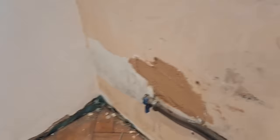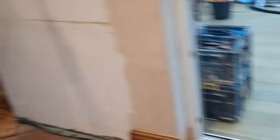All of the chases are filled everywhere - that was the first order of priority. Get all the bonding done fast because that's going to take the longest to set. Now that's done, the next most important thing is to get this sealer on as fast as possible. Kieran is putting SBR on all the areas that we're going to plaster because it needs to go at least tacky before we can start plastering. Whilst Kieran's doing that I'm going to get all the beads nailed on. We are currently at twenty past one, so time is ticking.